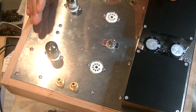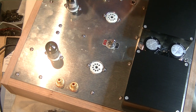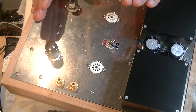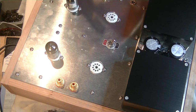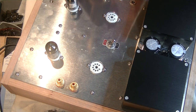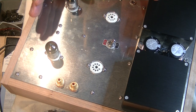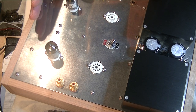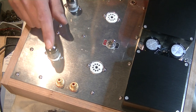One of the things I wanted in my newest phono preamp, besides to try out the Russian tubes, is that quiet, vintage 12AX7s with balanced sections that sound good have become incredibly expensive. You can easily pay $100 for a tube, $200 for a pair for the good ones. And even the better ones typically go for $50 a piece. So I wanted to try some other preamp tubes. Right now I'm actually experimenting with the 6N23P, another Russian tube.